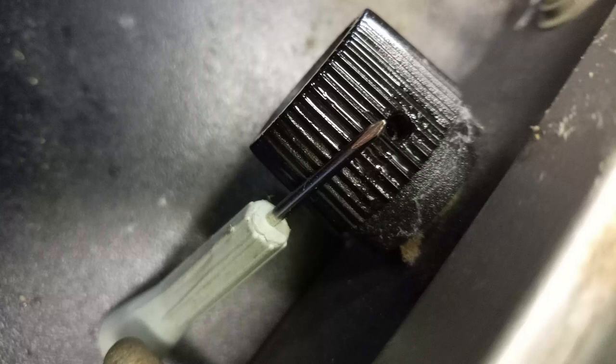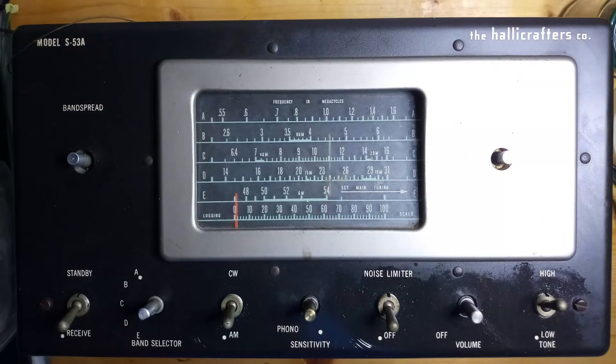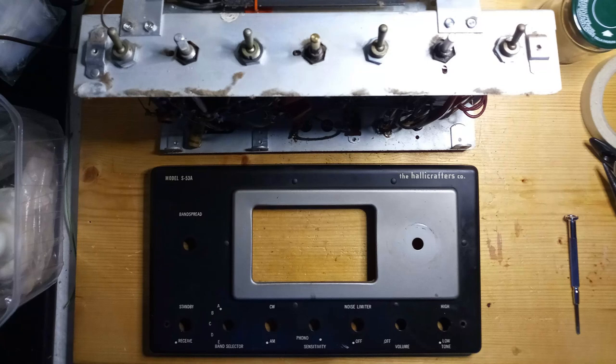Considering that most of the shafts are perfectly round, with no shape, the knob screws have been tightened very hard to make sure that the knobs would not become loose, therefore some oil is used to soften them before trying to use the screwdriver. After the knobs, the lever switches should be released by removing their external rings. In fact, the switches and the potentiometers are attached and will remain attached to the chassis.